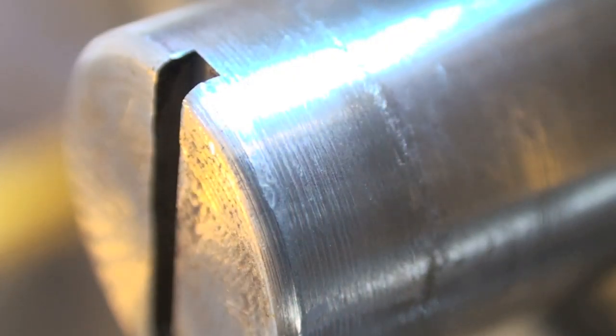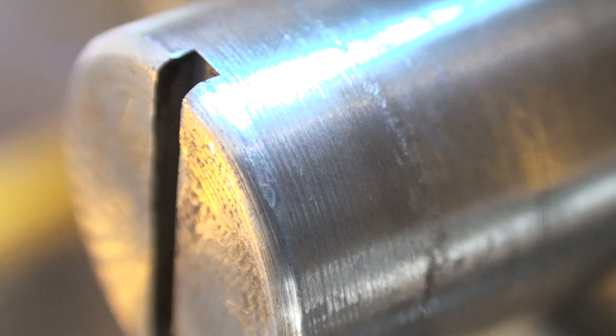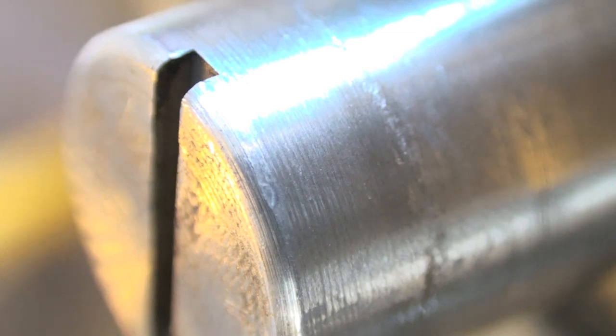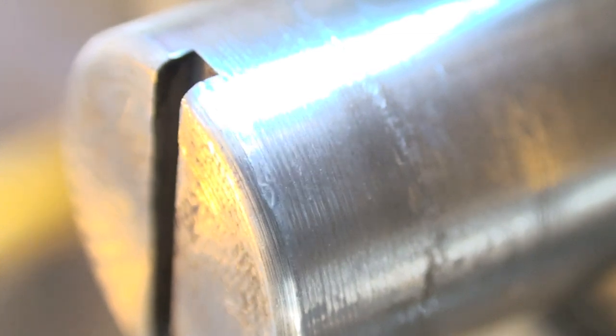Did notice something interesting on this. This is a picture of the end of the shaft. Now, these things only have two bearings, one at the end of the compressor and the other at the motor. It's a real heavy one at the motor, but they don't have one at the other end of the motor, where the shaft just sticks out like this. And the problem I saw was this thing actually moves.